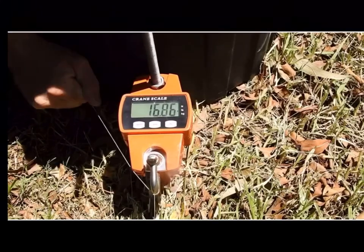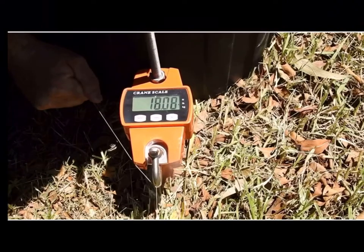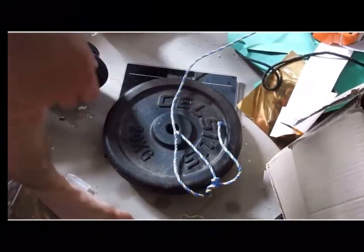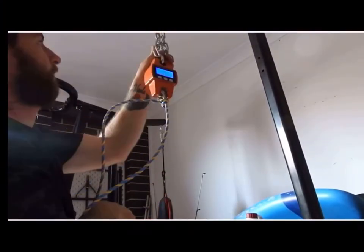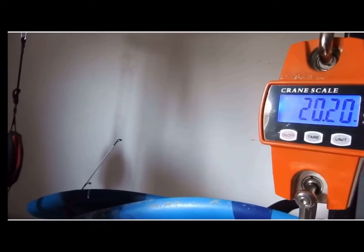These four tests shown are just some of the probably 10 or 12 that I did with this setup before I went back to the manufacturer, who recommended that I prove and calibrate my dynamometer. So I'm using a 20 kilo weight. On a scale it showed 20.4 kilos, and the dynamometer shows 20.25 kilograms, so it's reasonably accurate for what I need.